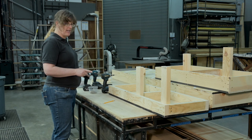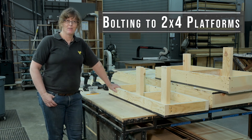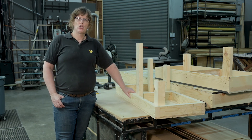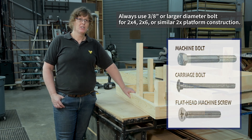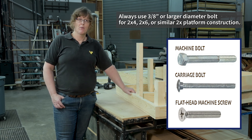Let's say we need to put in a leg, but we want it to be more secure. You have the option of drilling and bolting — not everyone's favorite task. For a 2x4 going into a 2x4, you should always use a 3/8 inch diameter bolt, whether that's a carriage bolt or a machine bolt. Quarter inch and 5/16 bolts just aren't going to have the strength you need at that bolting point. Anytime you're bolting from a 2x4 into a 2x4 or a 2x4 into a 4x4, you probably need to use a 3/8 inch bolt, especially if it's getting to be a high platform.